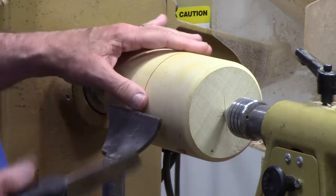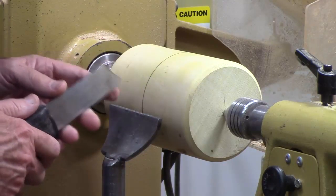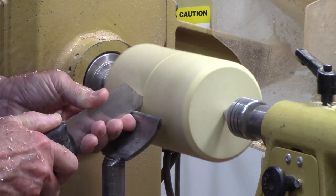It's over four inches thick, so it's a little too thick to cut with a thin parting tool all the way through. That's why I want to use a bandsaw. I've marked it about halfway and I'm just going to score it and mark where I'm going to put it on the bandsaw.